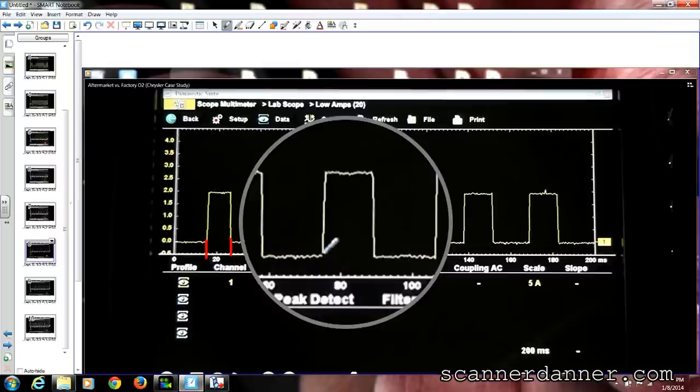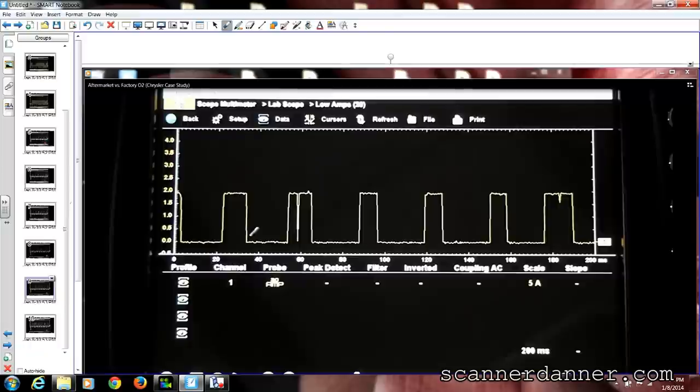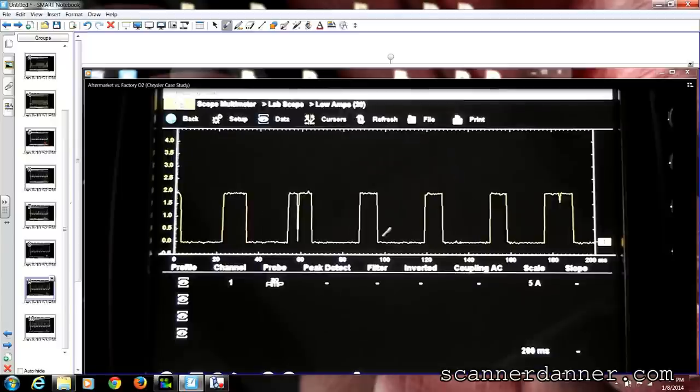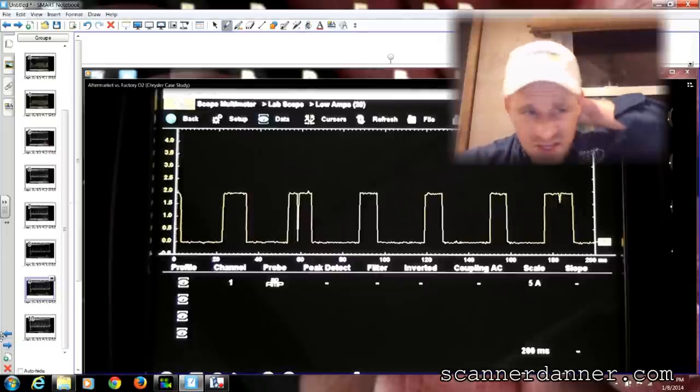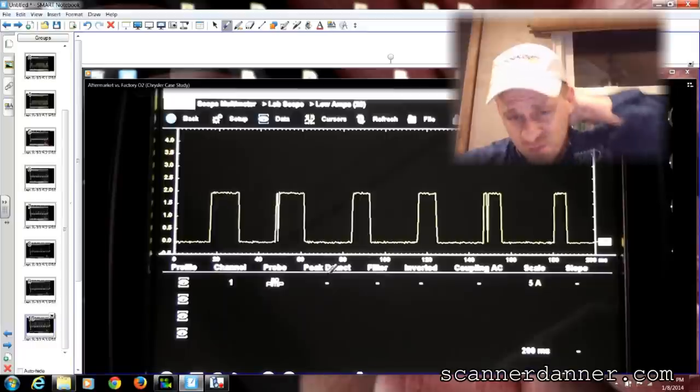Let's find one that's a little bit closer to the line - this fatter one here: 2, 4, 6, 8, 10, 12 - maybe close to 14 milliseconds of on-time. Another picture: 2, 4, 6, 8 - so a minimum of 8 milliseconds, and some of the fatter ones are 14. That is a significant difference in pulse width. One more shot - same thing, between 8 and 14 milliseconds of on-time.